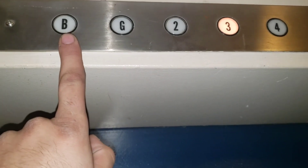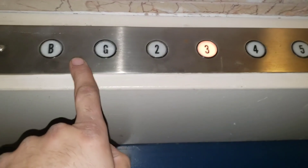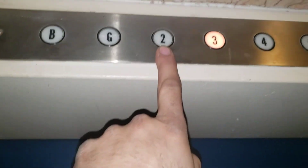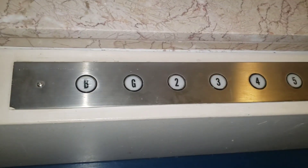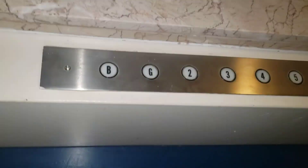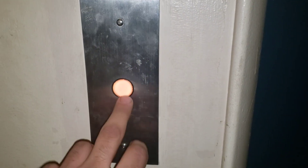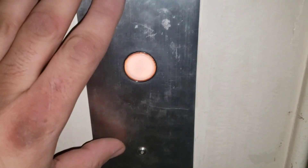If I were to go downstairs, I'd bet I could get it to come down here, but we don't really need to worry about that. I think I'll see that the two-call light is on. I can get the key and we'll go upstairs and have a look. Here I am at the second floor — it is registered, and it's not stopping. I'd be willing to bet that the 2S relay isn't picking up.